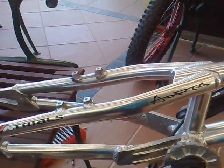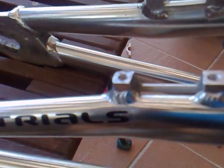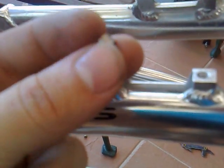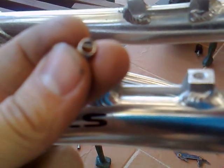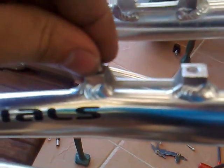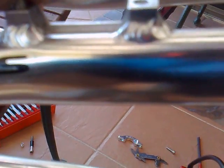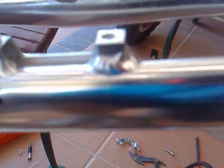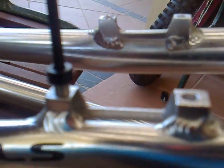Okay, let's get on to doing the helicoil. We'll go on to this mount bracket here which is center screen. This is the helicoil, which is like a threaded insert. There's a little tang on the bottom which goes across the diameter of the helicoil that faces down in the hole. Just need to get it started. Once it's started you use this tool here which is supplied with the kit, which has a little gap that goes down onto the tang. This helicoil is inserted onto the thread.